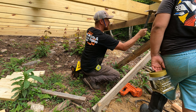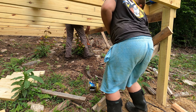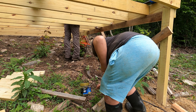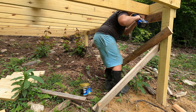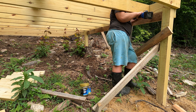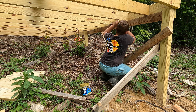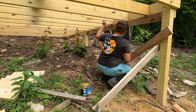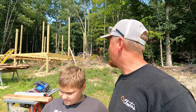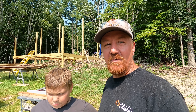The reason I did it that way is because I figured out that when it starts to pinch toward the end it trips the breaker on the Geniverse since we're running it right at max capacity. But if I go to the other end and spread those boards out — we're talking red oak inch-and-three-quarter thick boards that we're ripping here — if I can keep it from pinching the blade, we made the entire cut without kicking a breaker. So we're getting the job done up here with no other electricity, just solar power.